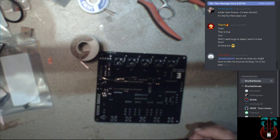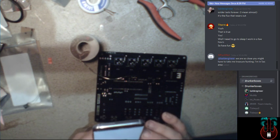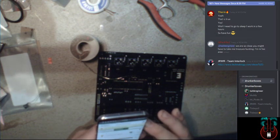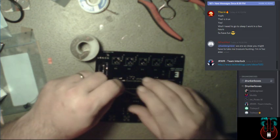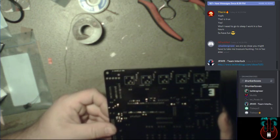But I'm not sure which one would be faster if you do binary values or bitwise shifting. Well, if you do a shift, that's 1 clock, and then to set the actual port register is another clock. So here's the website where I found the code. But if you use digitalWrite, all bets are off because it does a whole bunch of other shit.